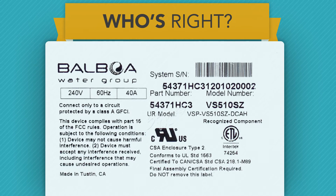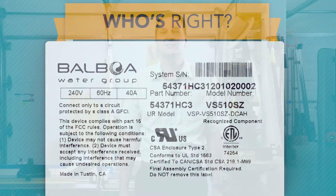In the United States, utility companies are required to provide a split-phase 240-volt feed to residential customers. This consists of two legs of 120 volts AC that are 180 degrees out of phase with one another. The AC voltage oscillates from plus 120 volts to minus 120 volts.